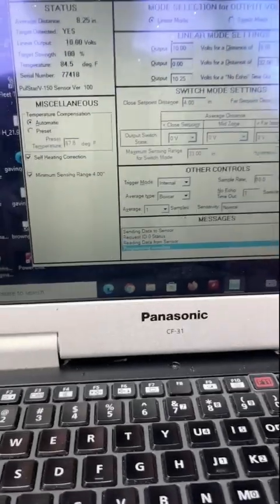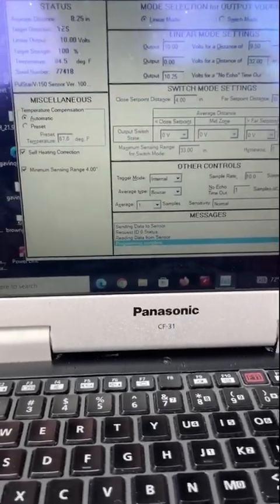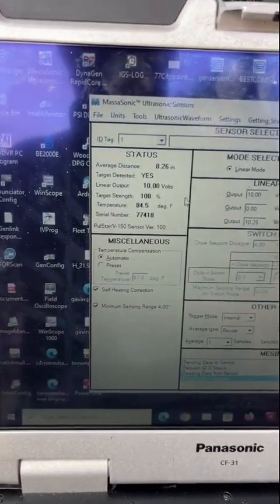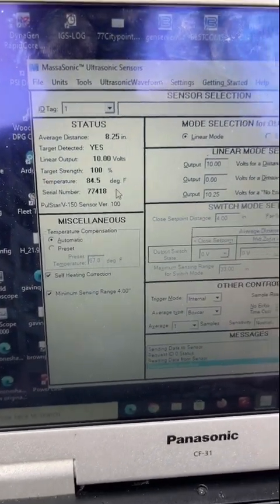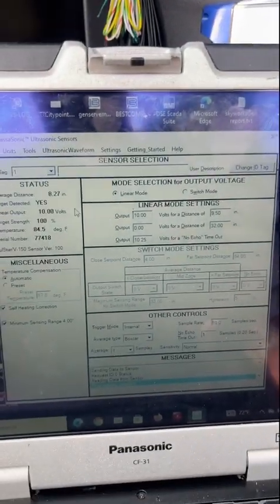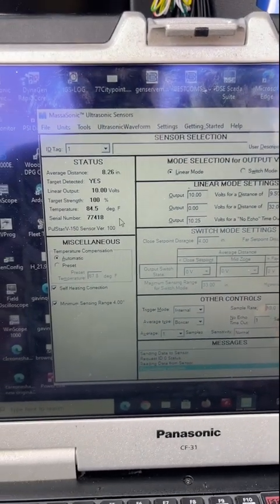And we raise it up a little bit so they think they're going to run out of fuel before they actually are. Hopefully they never get themselves in that situation, but it's just to grab their attention. This thing's programmed so when it gets to like 50%, it starts sending text messages and alarms letting them know that the fuel is low.